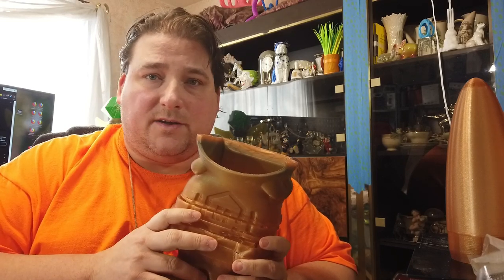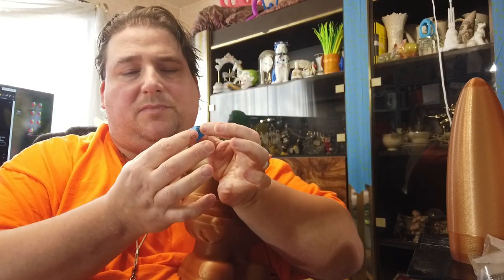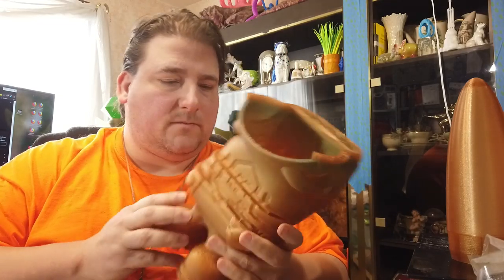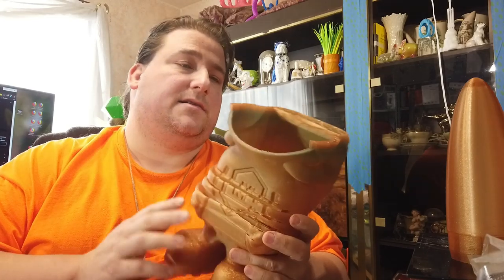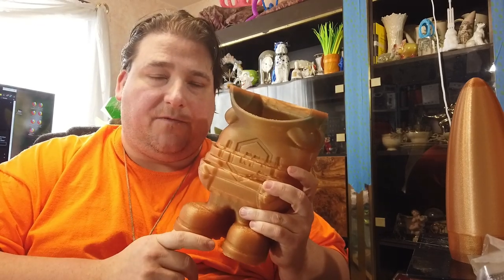What I need to do is upgrade the cooling on the printer. With the stock 0.4 millimeter nozzle it comes with, you won't encounter this problem, although I did have a slight cooling inadequacy on the back side. So I want to design a double-header cooling duct. They sent me the STL file for the cooling duct. I'm going to try to split this and make my own little cobra head so the air comes from both sides. I think the fan — a 40 by 20 millimeter blower — puts out enough air, it just needs to be around the entire printed part. I will reprint this again once I get more of this filament, because I want to make my big golden Filbin.